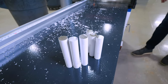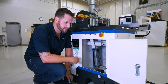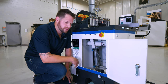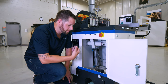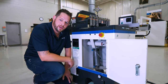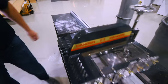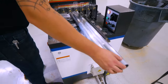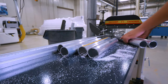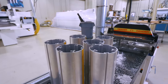For denser materials — brass, solid aluminum rod, or even plastics with a low melting point — I want to slow the traverse down so I don't create too much friction and melt the material. Versus something like lumber or MDF, solid woods, I don't have a problem speeding that up to achieve shorter cycle times. These flow control valves at the top and bottom control the speed at which the clamp comes down, the saw traverses up and down, and releases, so I can balance cycle time and cut quality.